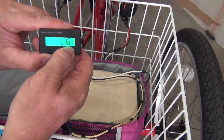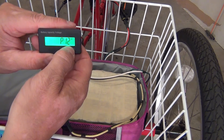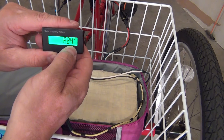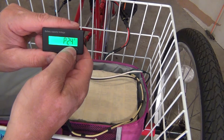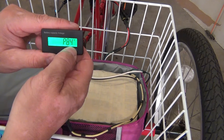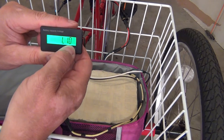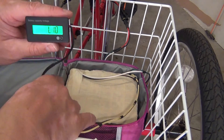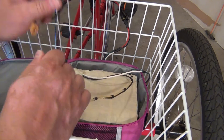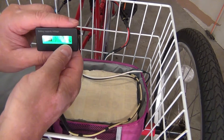It can go all the way up to 26, and then it goes into your lead acid settings — there's 24 volt, 36 volt, 48, 60, and it keeps going. So in my case I would put it to L10 — lithium, 10 series. Unplug it, power it back up, and it'll say L10 and boot right up.